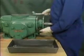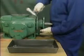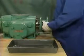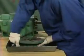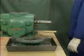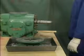off of the shafts. He'll remove the bracket gently and evenly, being careful not to bump the flange bolts, the shafts, and the mechanical seals. When the bearing bracket is removed, the mechanic places it in a cleaning pan. This completes the initial disassembly. Now try a question to see if you understand what we've covered in this part.